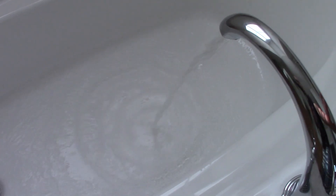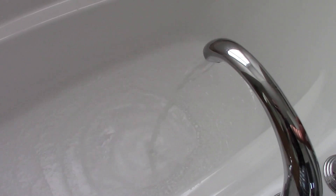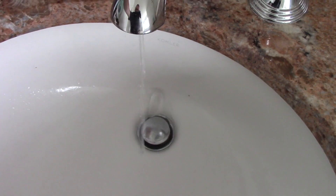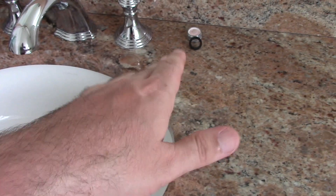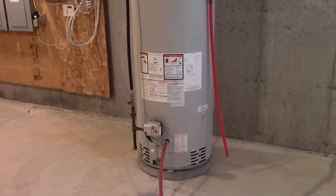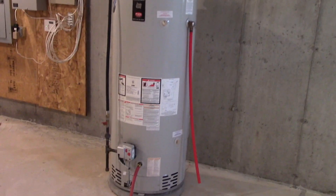Go ahead and just check one more time — water looks great. Our system is all refilled. And needless to say, once you have a full stream of water coming through your faucets, make sure you go ahead and reinstall the aerators and the O-rings back into the faucets. And once everything is all full and you've got the air out of the lines, you are now ready to restart your heating source.